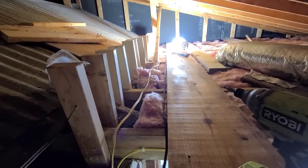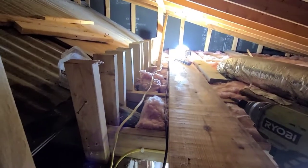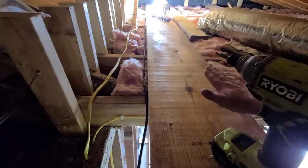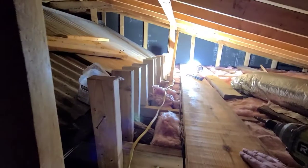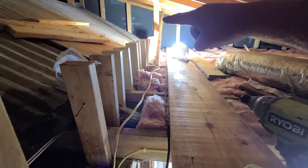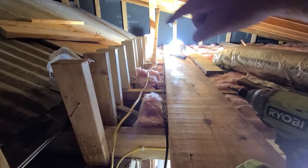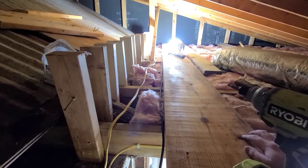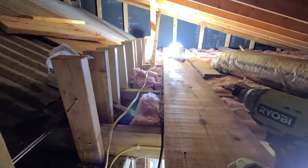After about an hour, all the soldiers are in, ready to be faced up to the first level of the beam. I've got to finish cutting out that knee wall right there so I can get this beam in place. Once I get that out, I'll be able to put the beam up in front of it, screw it to all those soldiers, and we'll be rocking and rolling on the first level.